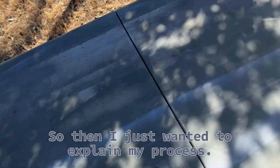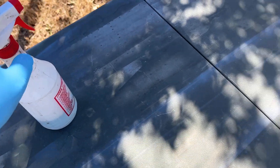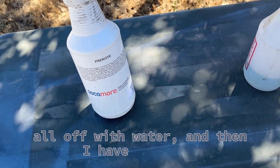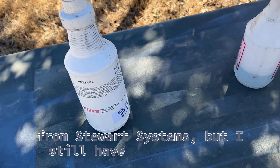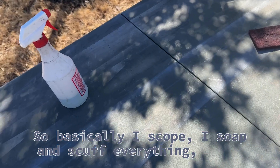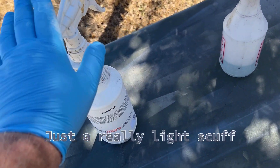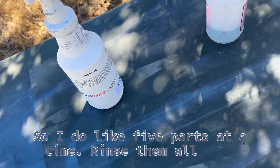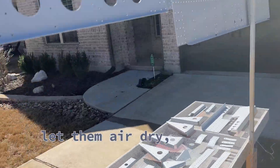My process: I scuff everything with water and a couple drops of Dawn soap, do my initial scuffing, then rinse it all off. I also bought some Eco Etch from Stewart Systems but I still have pre-coat to run through first. I soap and scuff everything, rinse it all off, then spray with the pre-coat and do a really light scuff — not a hard scuff since I've already done it. Make sure you rinse the pre-coat off before it dries. I do about five parts at a time, rinse, then let them air dry.